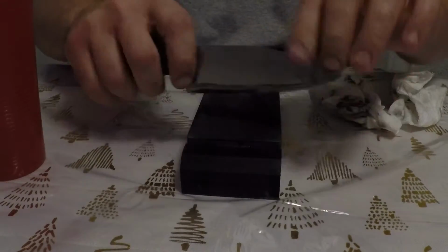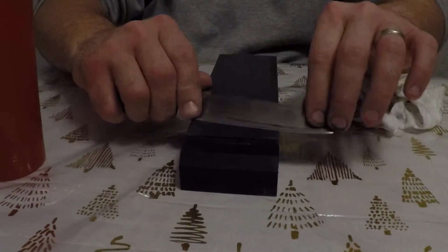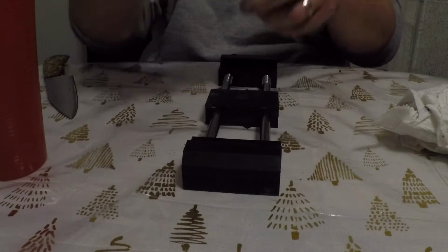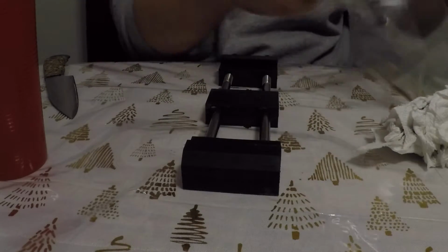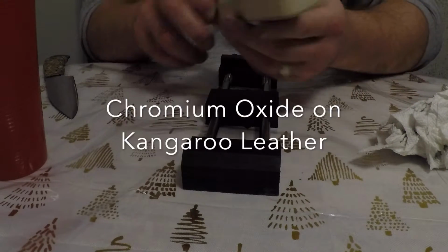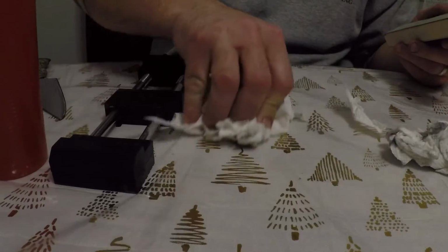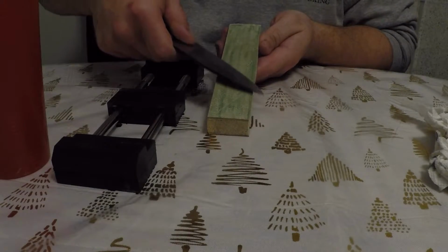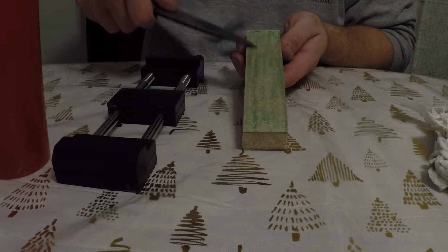I think just the way that the steel responded to it and the pressure that I applied, I applied more pressure with the plain blade, which in turn shed more grit. And that was the O1 tool steel. With the 1084 knife, I didn't put much pressure because you don't really need to, and I wanted to minimize any chance of folding the edge over and making more work for myself. To deburr, I pulled the knife 3 times through end grain of poplar.